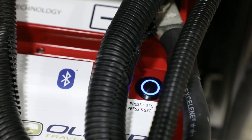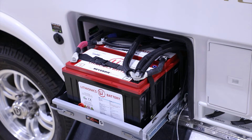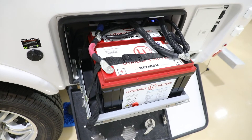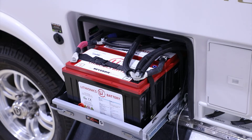These batteries are pretty similar to the larger ones as far as storage goes. You will want to discharge them down to about 50%. If they stay in storage longer than six months, you would want to charge them back up and then discharge them back down to 50%, which is good for roughly another six months. If you are doing short-term storage — say two or three weeks — that's not necessary. You only need to drop it to 50% for long-term storage, which is considered anything three months or longer.